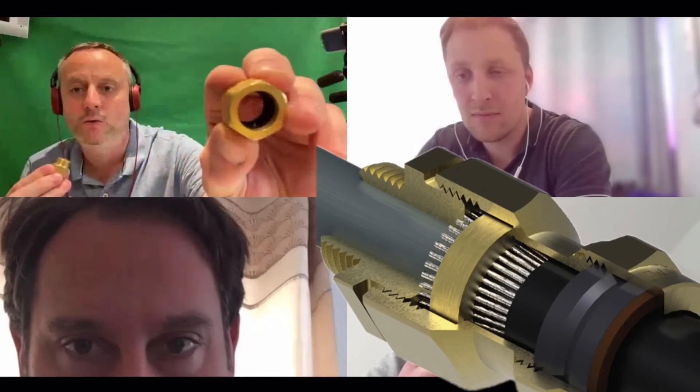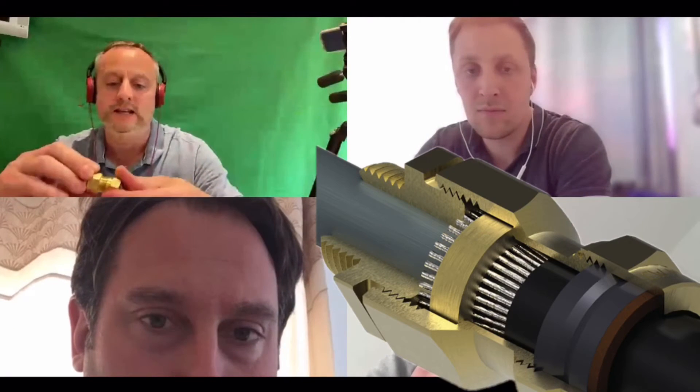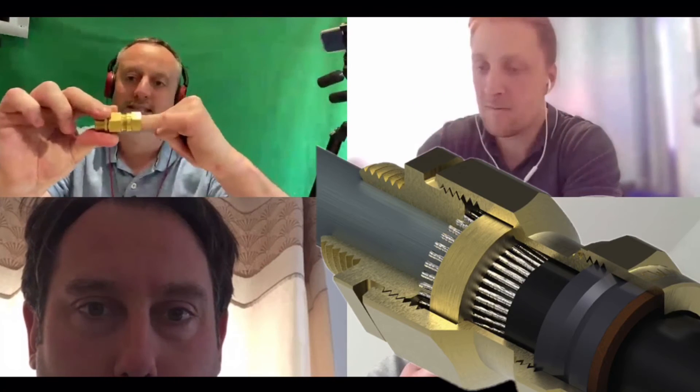No, you can't use BW glands outside — they have no seals within them so they will not be watertight. Chris from CJR Shop did a video where he changed an outside socket that had the wrong glands in and the glands were full of water — check that one out because it proves that if you use the wrong kit you'll create a massive problem. This is the CW gland. It would have a locking nut and an earthing ring, but the big difference is you can see there is a rubber seal inside. When that goes against the PVC outer of the cable it starts to create a seal.